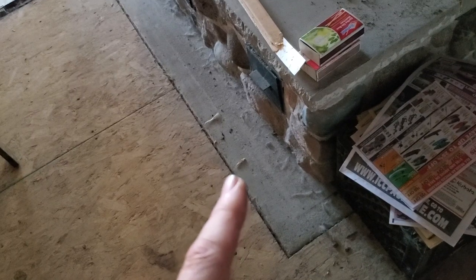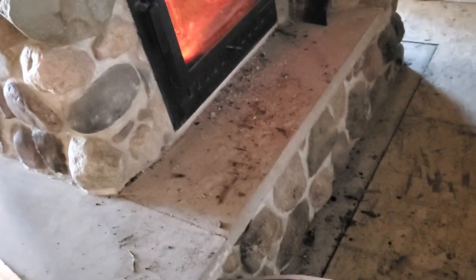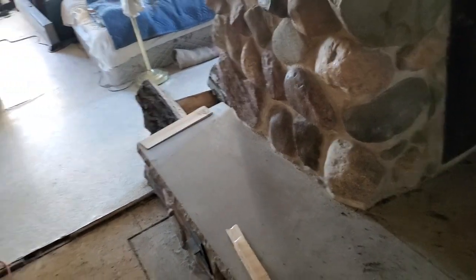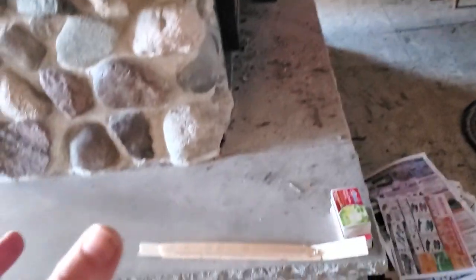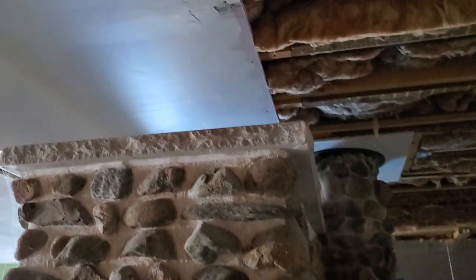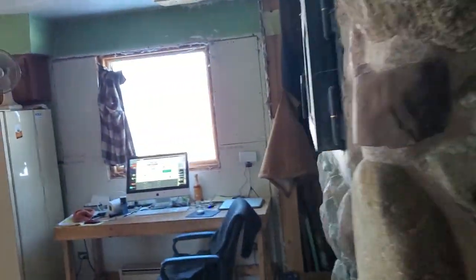As you can imagine, this pad here is supported below by two steel beams. It's a six-inch reinforced concrete pad, and the framing is actually stood off from that pad. Down in the basement there's a fairly substantial structure all the way down to a new foundation. It was quite a bit of work to tear out this whole floor and reframe it with this in mind. I did put some drywall up there temporarily, and the exterior of this stone will be about 110 degrees for about 24 hours after a firing.